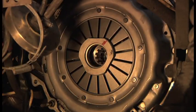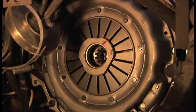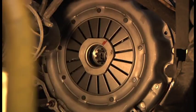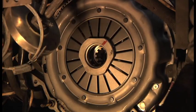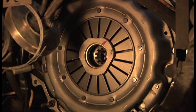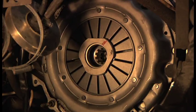What I'm doing here is I've got the light right in front of my face, so it's right in line with my eyesight. Because when you move it to one side, you cast shadows. I don't know if you can see that. Look, you cast shadows, and it gives you an optical illusion as to whether it's centre or not. So by having the light right in front of your face, you're looking straight down the barrel, as it were, and it's lit as flat as possible, almost like a ring flash.